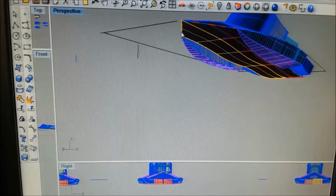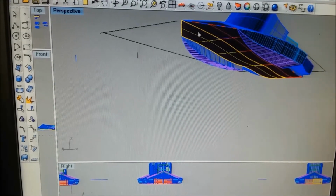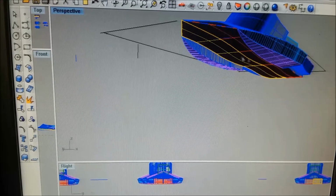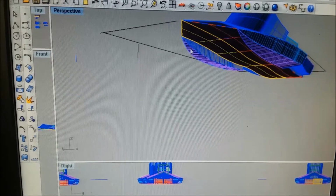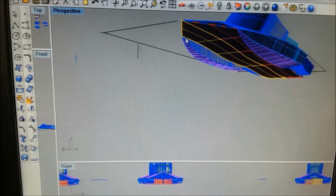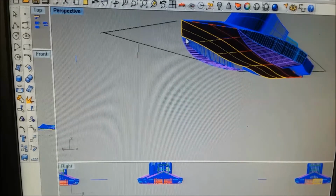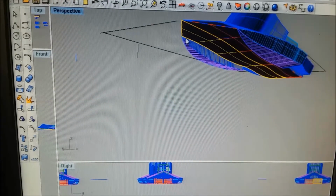See, as long as you have a bend that's just crosswise or diagonal, only bent in one direction, then you can just form that. This is intended to be a welded hull, so the stitches are welds. You'd put a tack up here, and you pull those two sheets until they touch. You can clamp some angle iron on it, or you can get a chain hoist, what's called a come-along. But you get the first two bits of it together somehow,